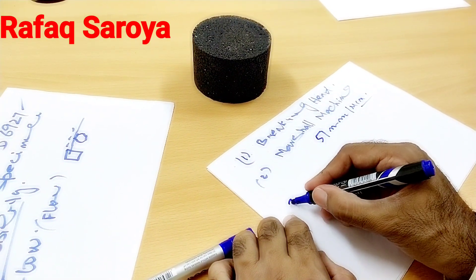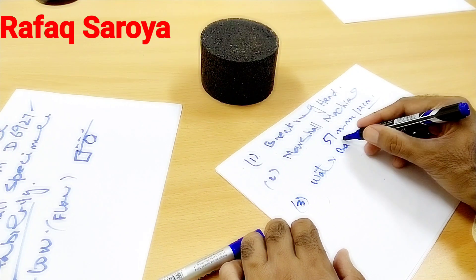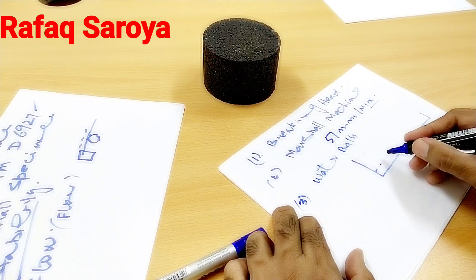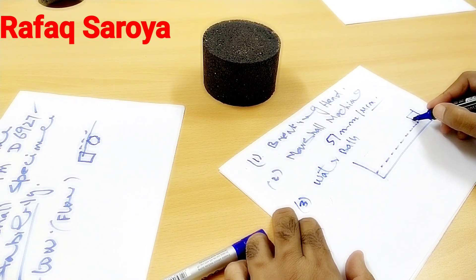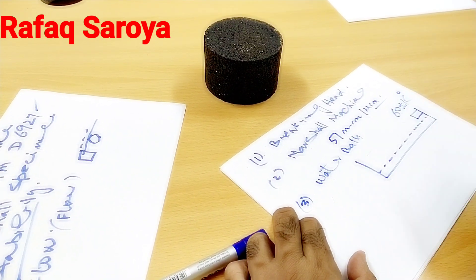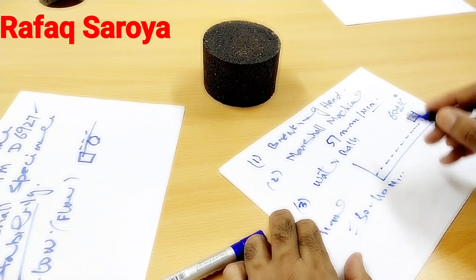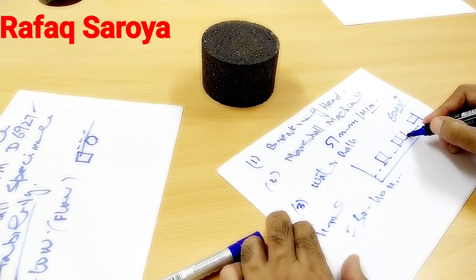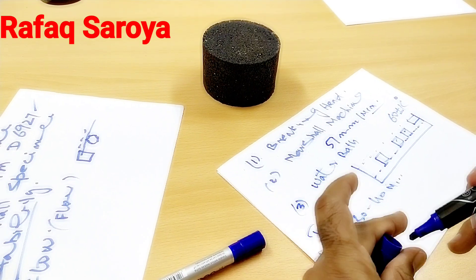Until failure occurs. After this we have our water bath. At the bottom of this water bath we have a perforated plate. The temperature of this water bath should be controlled and is equal to 60 ± 1°C. The time required to heat the specimen is 30 to 40 minutes. This specimen will be dipped into the water, as shown here, and it will remain in water before testing for 30 minutes.